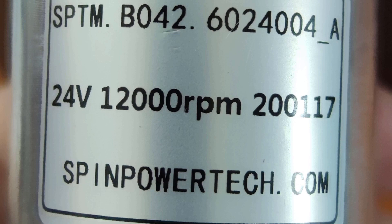I tried to find some details but could not find any on the Snapmaker website, so I just opened the spindle and took a look at the motor. There are no data sheets either, so I will stay with the 50 watts assumption. This means no more than two amps and we should be fine.